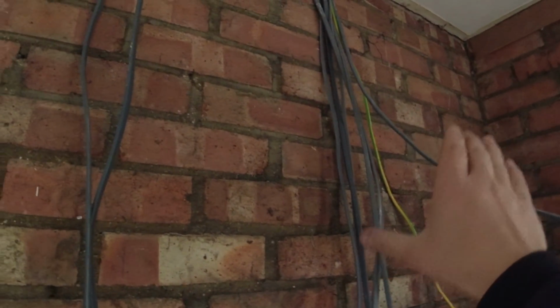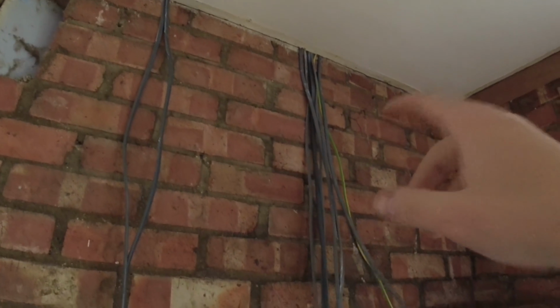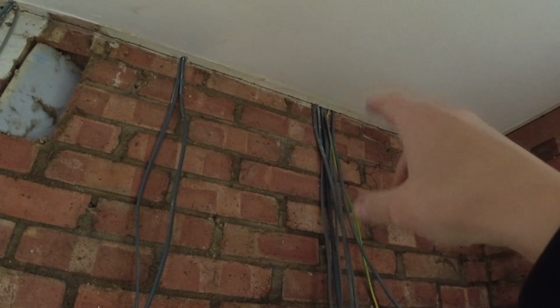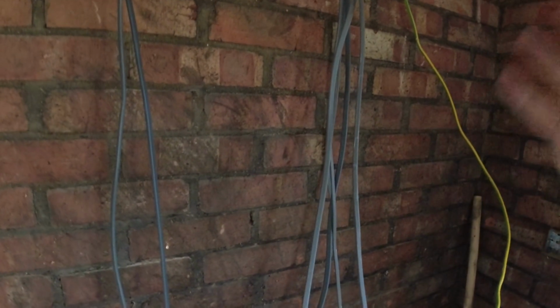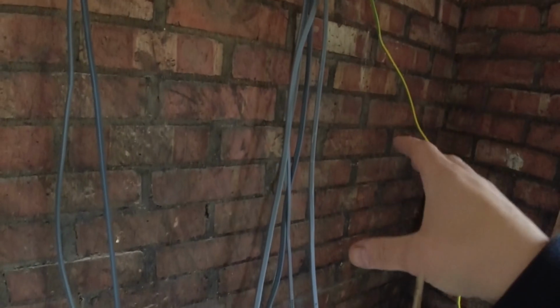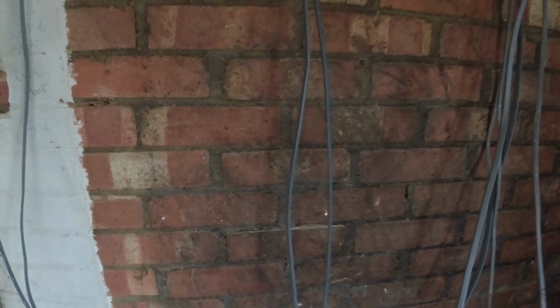So our mains cables are growing, obviously, as we rewire circuits, they grow here. The clients just said to me in the future they're going to want an EV charger out on this wall. So what I'm going to do is drop a 10mm out of this board, literally down here, and we'll end up putting a whisker on the back of that wall for them. And then eventually, when they get a charger, it saves me putting in an armoured or something. So we're going to do that.